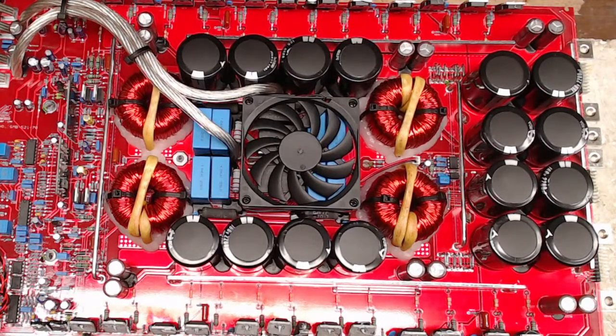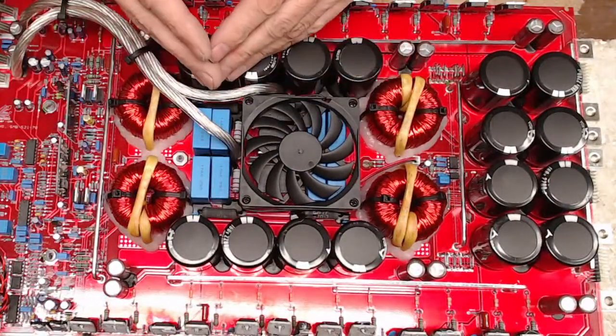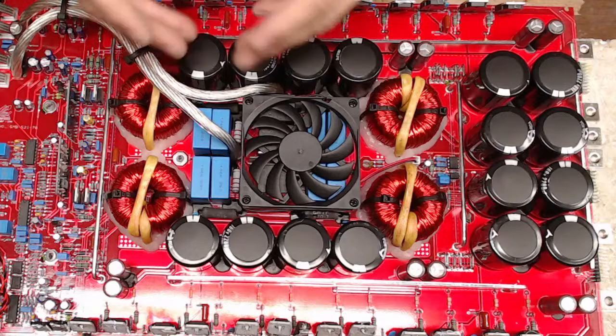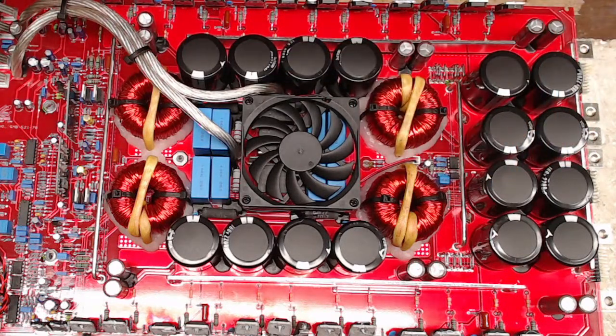Yes, those chips usually do survive. And that's the thing, don't get me wrong, diode setting works great too. It shows you the forward voltage of a junction, I should say. But diode setting doesn't show you the resistance value of a complete circuit. It'll show you the forward voltage of the complete circuit. So again, it just goes to different mentalities of how I approach things.